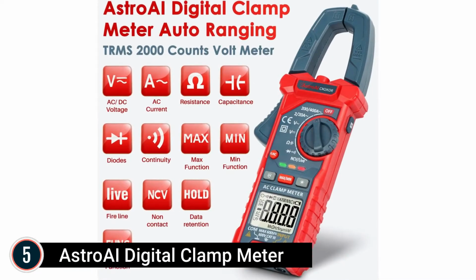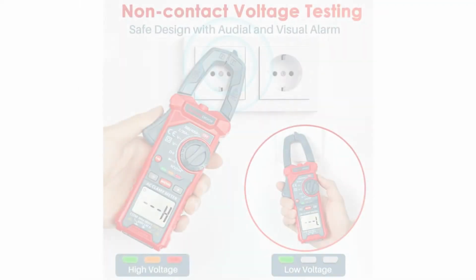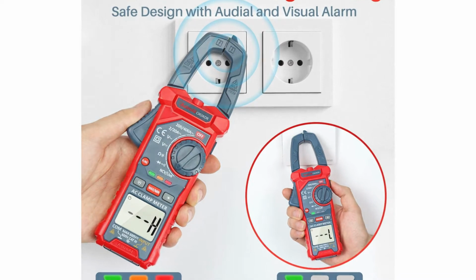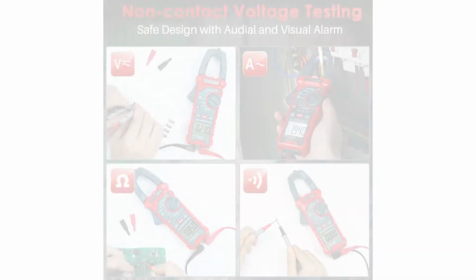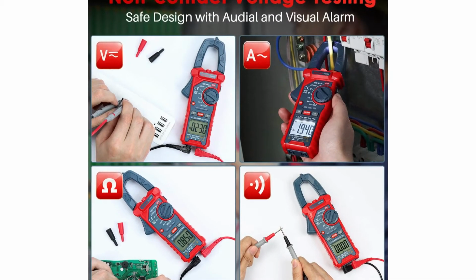Non-contact voltage testing. This clamp meter includes non-contact voltage testing with audio and light alarm. When the meter senses a weak AC signal, the green indicator light will come on, and the buzzer will produce a slow, distinct beep. When the meter senses a strong AC signal, the red indicator light will come on and the buzzer will produce a fast beep.